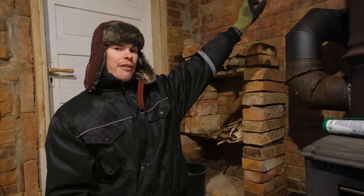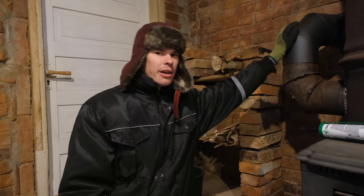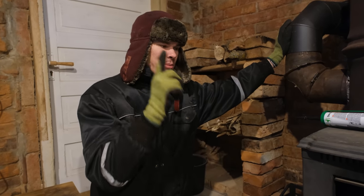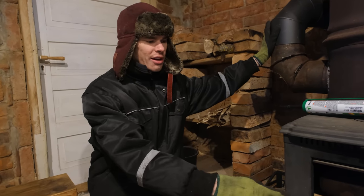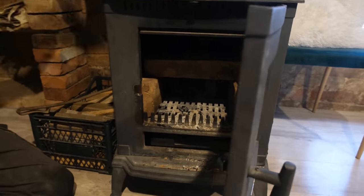We're going to increase the flue today. Yeah, it is called the flue or chimney. We're going to increase it all the way to the correct height over the roof. So we're going to add one more extra meter, and that hopefully will help with the draft flow back and also with the draft. The draft was never a problem once we made the rocket. The version here was drafting really well. Before, when we had the barrel, it was struggling to start.